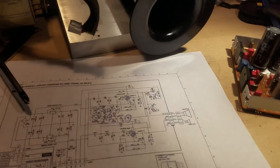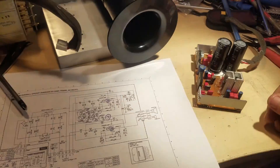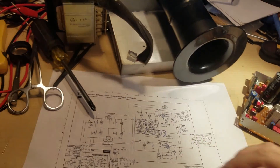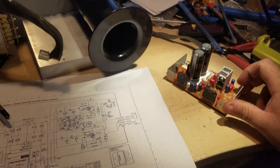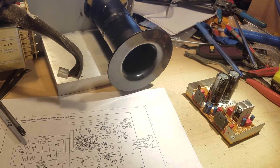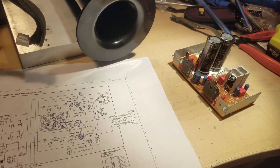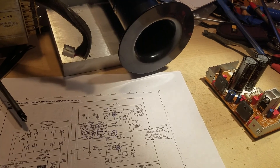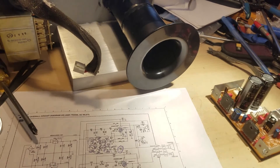Sure enough it works just as well. The bass is opened up a little bit more. So yeah, it works on the HS80 too. Anyone can kind of do what I do — I just had to create a parts list. I removed pretty much every single component on here and upgraded all the caps. This is for folks who may have come across my HS8 video but want to do the same thing to their HS80 — removing that limiter. This is how you do that.